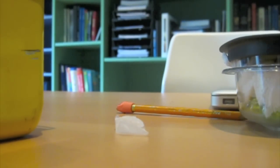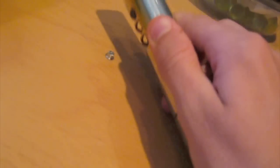So if you're going to do it like that, turn it to times 10. Do the same thing: put the little middle thing right there on top of the americium. Oh, that's on times 100. Oops. Your americium should go up to about 100 counts per minute, or 1.5 milliroentgens an hour.